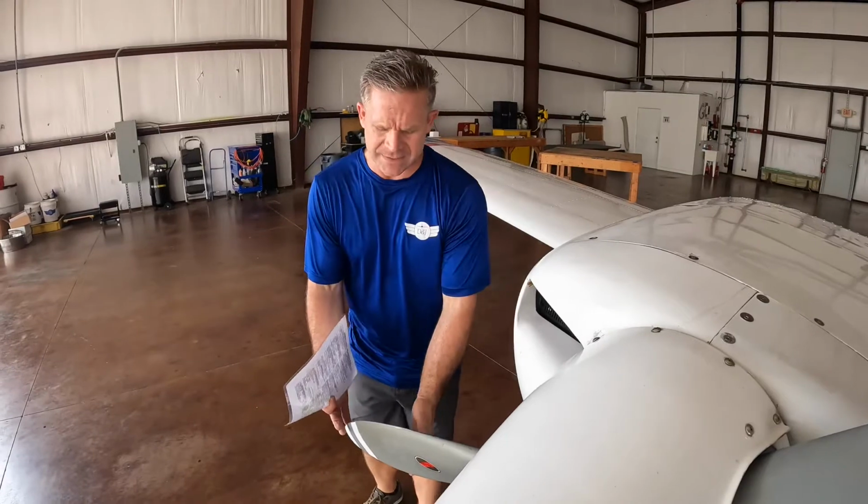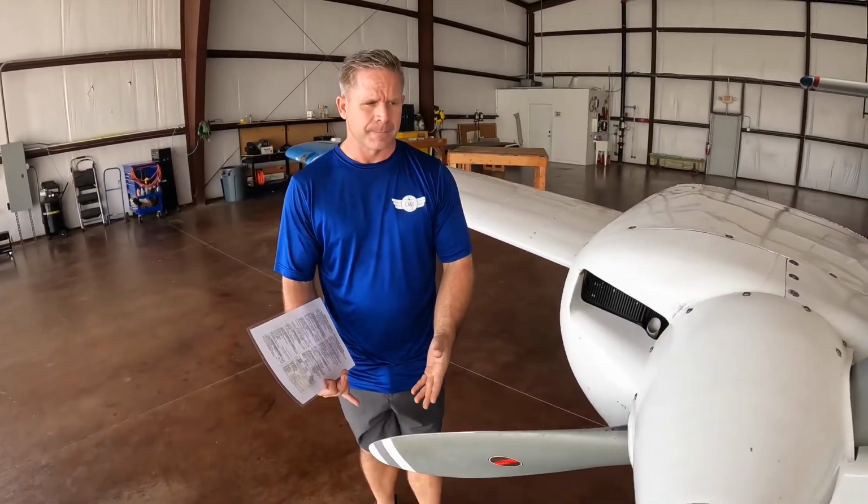As in our last video, you always want to ensure you treat this like a loaded gun. You don't want to start turning it. We have already confirmed our mags are off. So in theory, if I was to turn this, it would not start. But again, that's bad practice. You don't want to do that type of stuff.